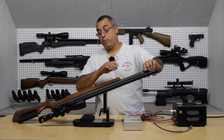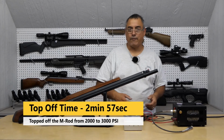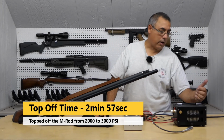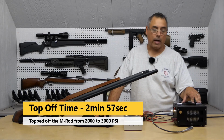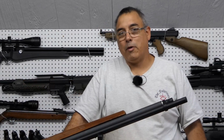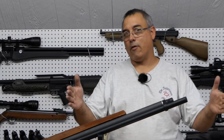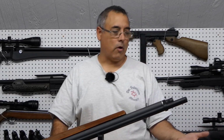Okay, we'll put on the video how long that took to fill, because I didn't time it on my phone, but I can check the video time. It started at like 35 degrees Celsius, went up to about 68, topped out. Again, if it starts tipping over 70, that's when you want to give it a break. But we're at 3,000 PSI, and it went from like 2,200 up to 3,000, and however long that took. And relatively quiet, not super, super loud.